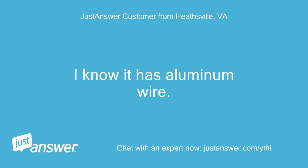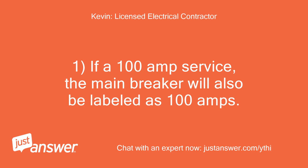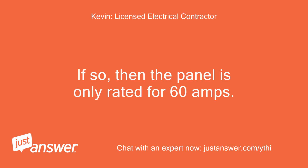I know it has aluminum wire. What size would the main breaker be if it is 100 amp? 1. If a 100 amp service, the main breaker will also be labeled as 100 amps. What if the 60 amp breaker is the main breaker? That is always a possibility. If so, then the panel is only rated for 60 amps.